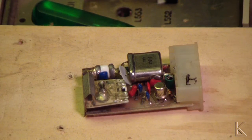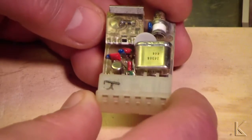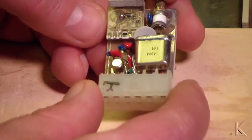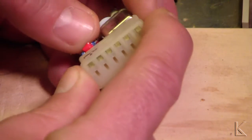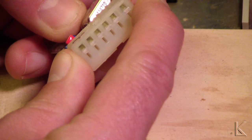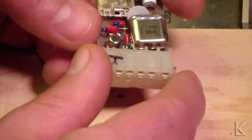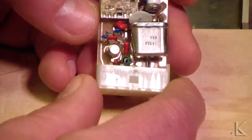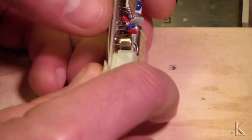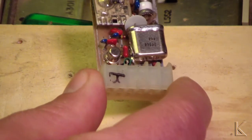So what we have is a variable crystal oscillator — one transistor, obviously an oscillator, some sort of sealed potted module. Our source crystal is 149.4444 megahertz, if that's right. Now on the top it says 145 R700. This is actually just a straight-up crystal oscillator — that crystal is actually cut for the frequency 145.700. It's a self-contained crystal oscillator. A little variable cap where you can push the crystal. That is probably a temperature sensor — I think these were temperature compensated. Either that or that's a heat source and this is a crystal oven. I'll bet you this is just a little self-contained crystal oven.